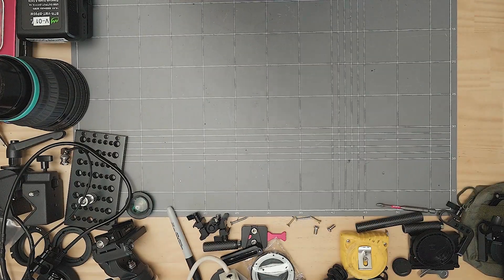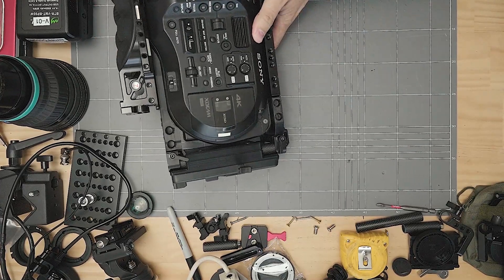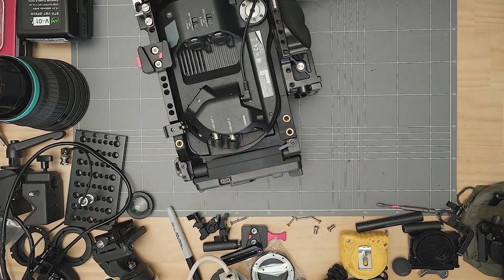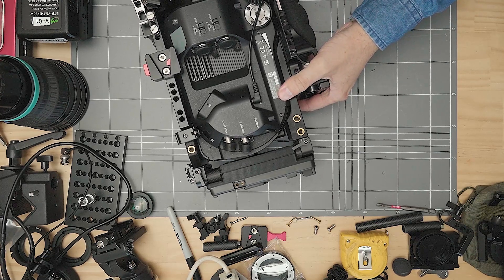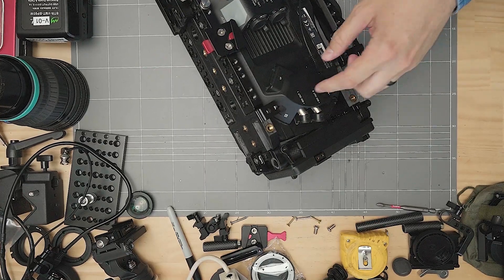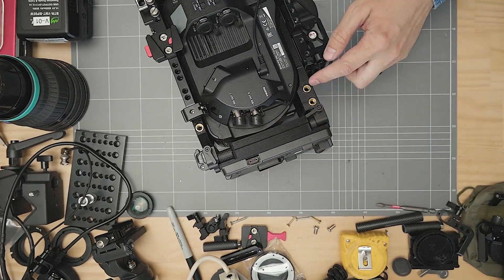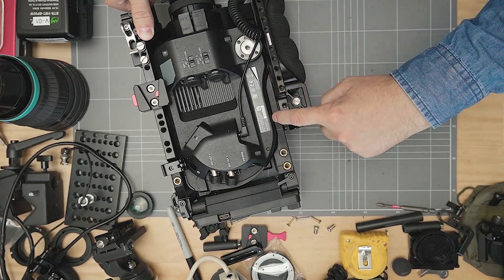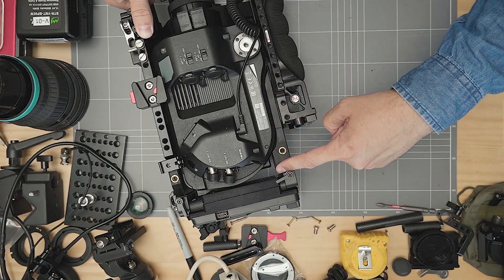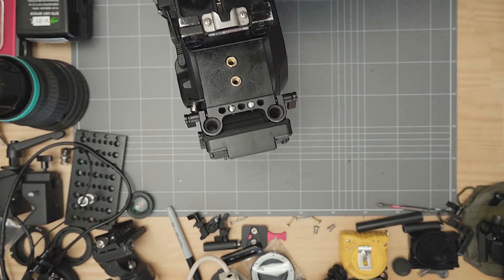So that's the 3D printed top and bottom plate for the FS7, as well as the V-mount back that goes with these top and bottom plates. I'm really happy with the design. I designed it specifically so that it can work in plastic and be strong enough — these are not high stress parts — particularly when they're combined like this and printed at really high infill in PETG or nylon filament. They should stand up really well, and I've been using this for probably four or five months now as of the publishing of this video, really putting it through its paces and abusing it, and it's held up really well — no signs that it's going to come apart.